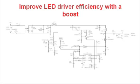This boost circuit is pretty much similar to the previous circuit. We have the linear regulator here, and we're doing a little bit of wave shaping of the current waveform to improve the power factor. But what we don't have is the dummy load resistor that we had in the previous design, and so that gives us some cost reductions and an efficiency improvement as well.